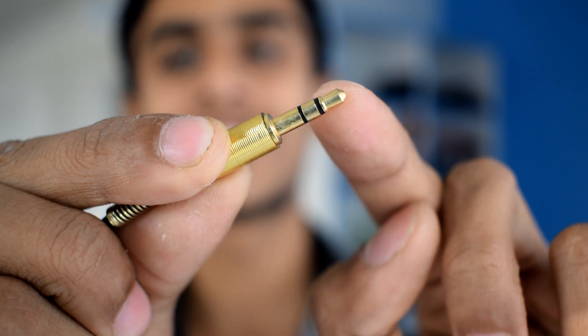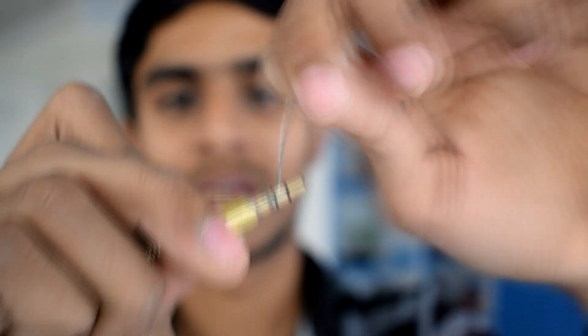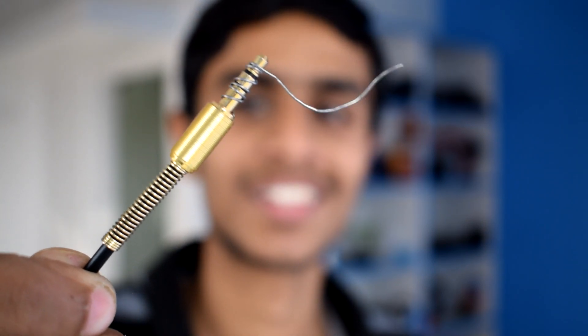This all happens because the camera's auto gain feature doesn't work that well — the internal recorder of the camera itself has noise. Let me show you that: I'm going to short these three terminals so the camera will record no audio. See, that is a hiss noise produced by the camera's internal recorder when I switch to the auto gain setting.